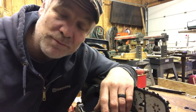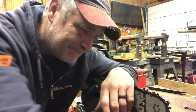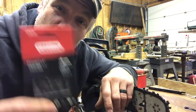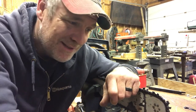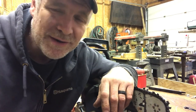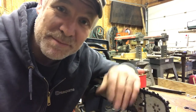So that's how I make a ripping chain. We're going to go out later today and run the chainsaw mill — hopefully if this rain stops — and I might throw the original Oregon chain on and try it to see how much of a difference it really does make. I do know I have a ripping chain on my Alaskan sawmill and it makes really nice smooth cuts, so with a little bit of time you can actually get a normal chainsaw chain to run like a store-bought ripping chain.